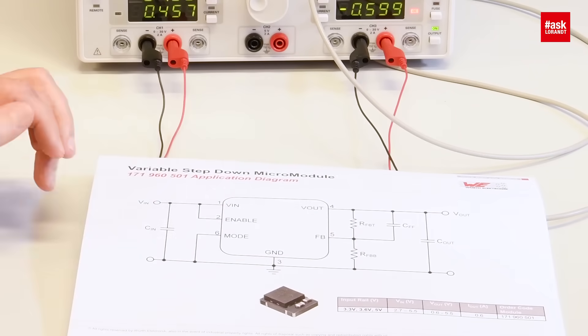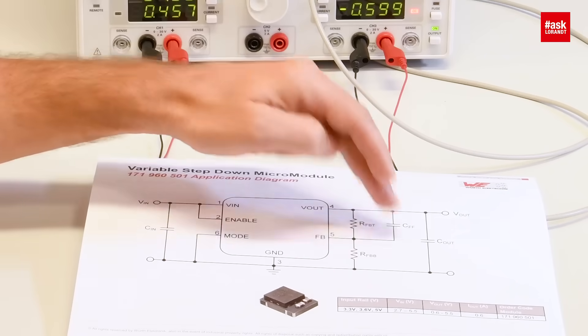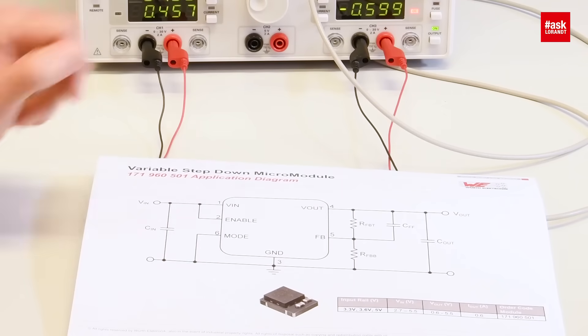Then there is another option. I can show you on the schematic. Here we see the schematic of the power module. We have a resistive divider to set the output voltage and a feed forward capacitor. This capacitor on this board is at a very small value because the board is optimized for high efficiency for battery powered applications, where under light load the device goes into burst mode. With a small capacitor the efficiency is very high because the number of bursts is very small. If we increase this capacitor to a higher value, then the device would start right away even if you apply the load instantly. So the customer just needs to increase the value of the feed forward capacitor. Yes, and this is the case for a non-mobile or non-battery powered application.